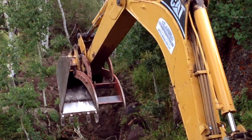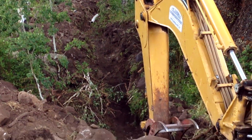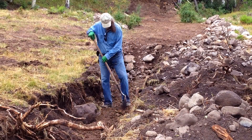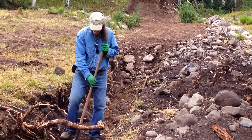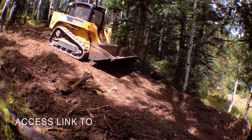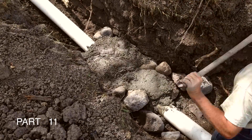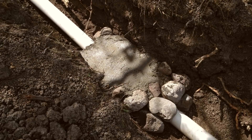We continued the process of installing our penstock pipeline, and this would continue until the end of July when we finally reached the powerhouse. The burial of the pipeline would continue throughout the month of August. The bedding of the pipe needed to be done by hand, but most of the work of burial was accomplished with the skid steer machine. At the bottom of the steepest part of the hill, we installed a thrust block to make sure there would not be any movement from pressure changes in the penstock.